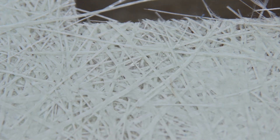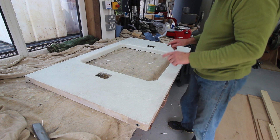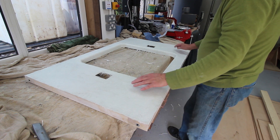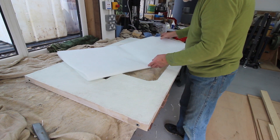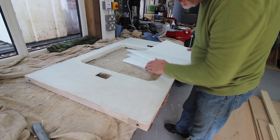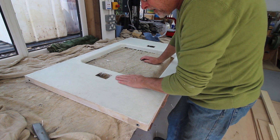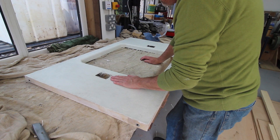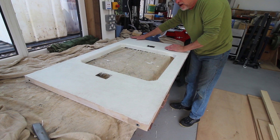You can see that I didn't put enough resin here to fully fill the weave. I'll show you a piece that's got fully filled - this weave here is completely full and totally impervious to water. I thought I was using a lot of resin but I've got plenty to go so I'm not too worried. The kit also comes with a surface tissue that takes out all of the individual glass fiber strands. For use in a mill I think this slightly open weave is going to get full of swarf, so I cut a tiny little piece of that surface cloth and put it on the corner here - it's going to come out really quite smooth.